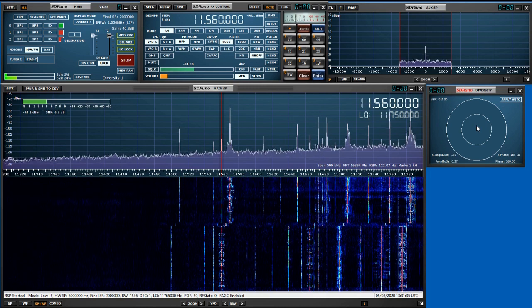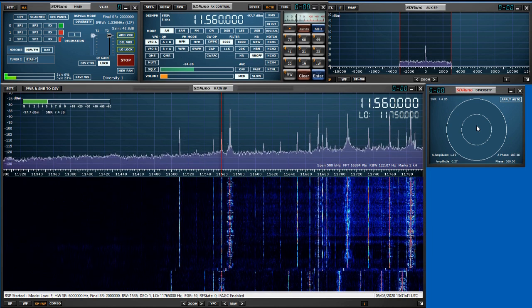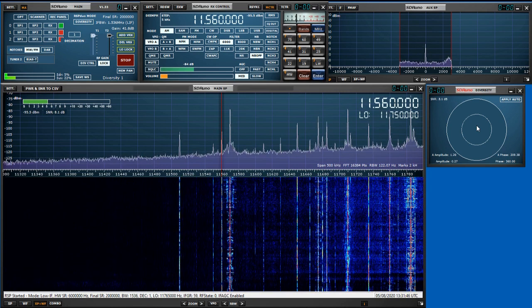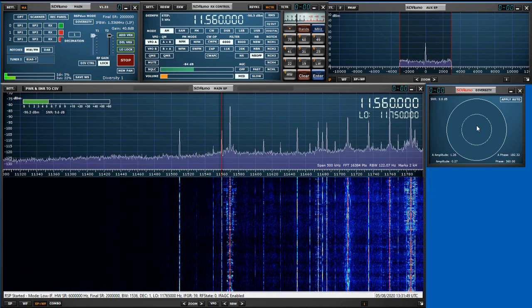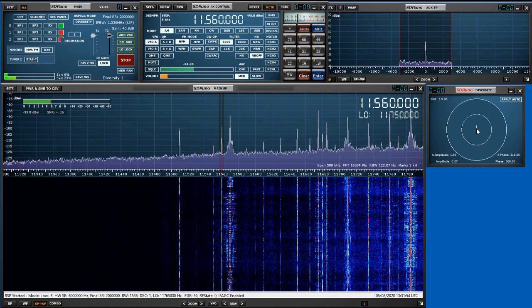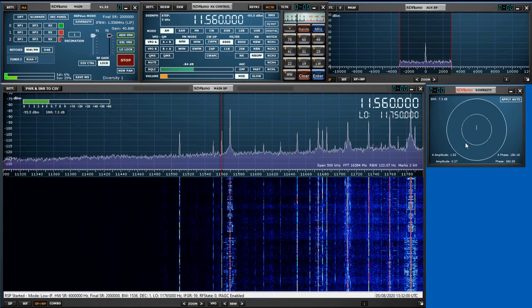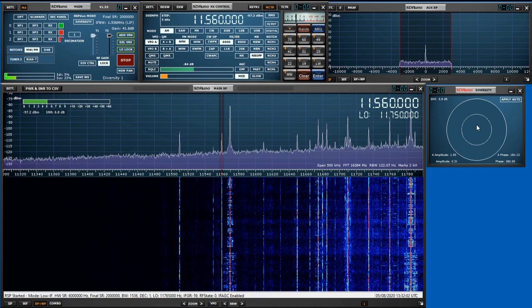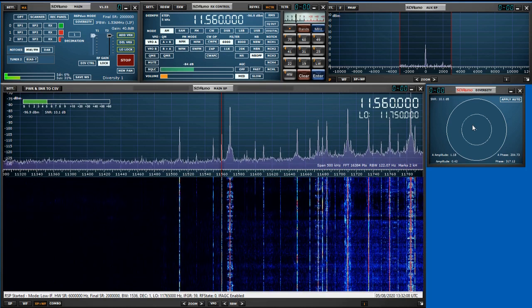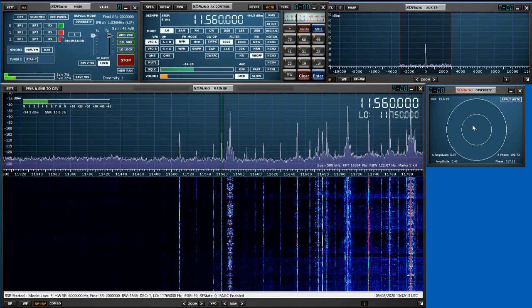The way things work is the two antennas basically provide IQ data, which is the analytical signal that has been converted from analog to digital through quadrature demodulation. This little box over here lets you basically phase the two signals together by adjusting the amplitude and the phase of the two signals so that they add or subtract — making things stronger or weaker. In my case, what I'm trying to do is tune the two antennas against each other so that I can make the biggest reduction in noise.